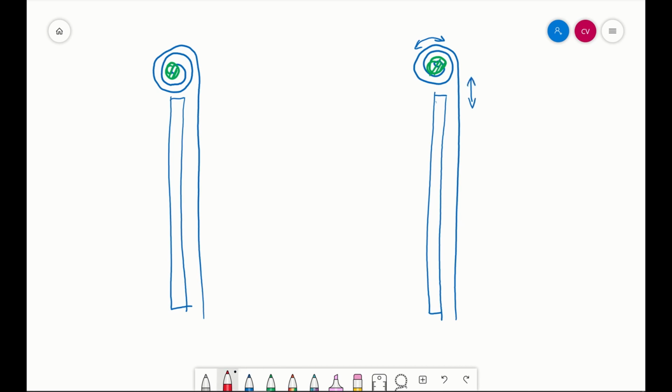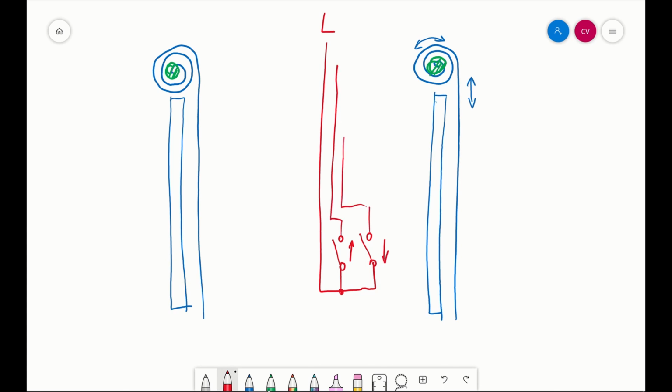Each of the motors has 3 wires coming to it. So one is coming from the phase, L. It's coming all the way down to the wall switch. And the switch has 2 buttons, one for coming up, one for going down. So there's those 3 wires coming through the wall. And there is a control box in here. And then there is the neutral. And the buttons are on springs, right? And they're blocking each other, so I can't push both at the same time.